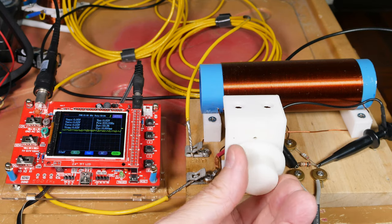So as you can see, it's perfectly functional. Not as sensitive as some of the others, but for a single-capacitor tuning radio, this is the best one I've found — in fact, this is the only one I would actually call a radio. It gets at least four or five stations; there are about 17 in my area. One comes in pretty softly, and I haven't changed the antenna yet — this antenna runs north-south, so if I switched to my east-west antenna I'd probably get more stations. If you're going to build one of these crystal radios with single-capacitor tuning, this is the one I'd recommend.